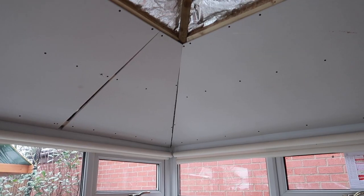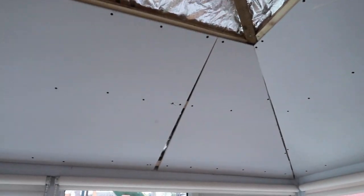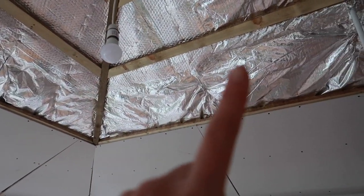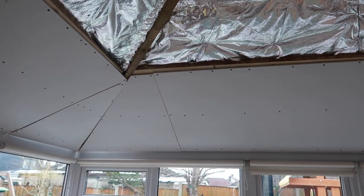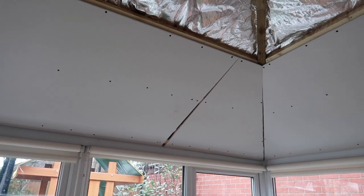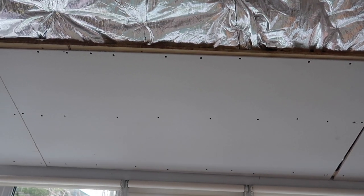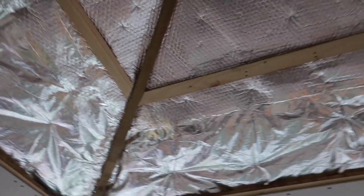Just a ceiling update — I've had to work slowly because of Christmas and looking after three children. I managed to get all the battens up and I've put my first tier of plasterboard in. It's not perfect — it's got gaps I'll fill — and there's a larger gap over here I'll figure out. Considering I've lifted them all myself and they weigh 12 kilos each, I've managed to screw them in and get them mostly straight. I've done it all by myself.